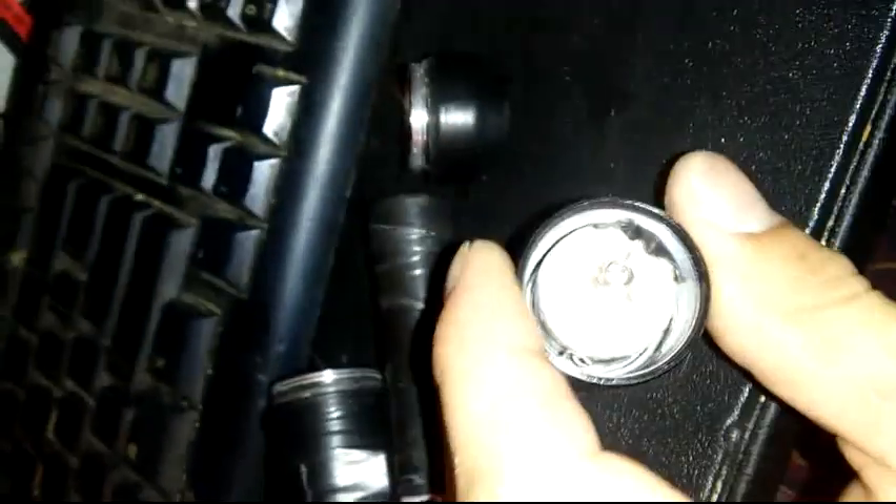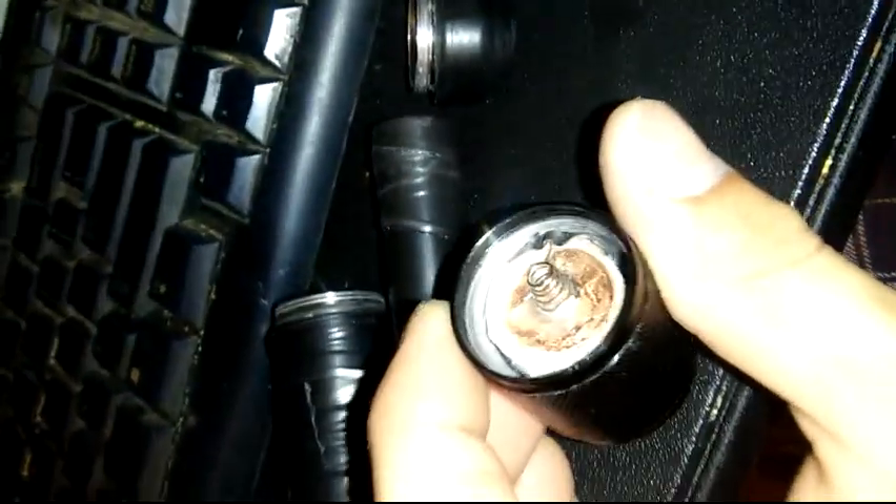You get a very simple, super bright flashlight — it all depends on your battery. I would not use a high-discharge battery in this light because that heat sink is only good for a little over an amp if you're leaving it on. This other one has a melted and damaged reflector because I left it running too long, which is why I put a momentary switch on it.